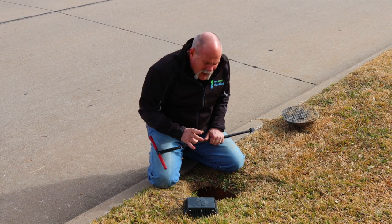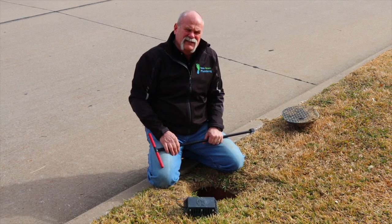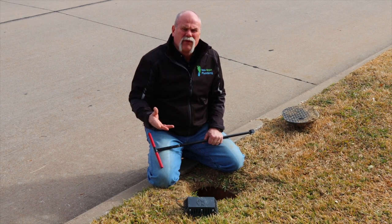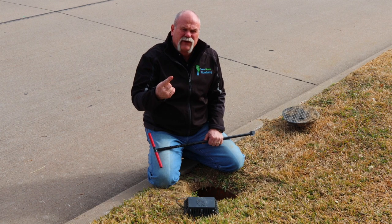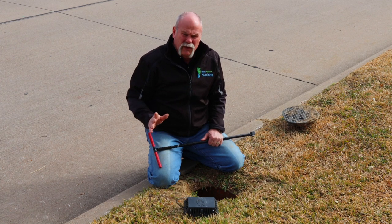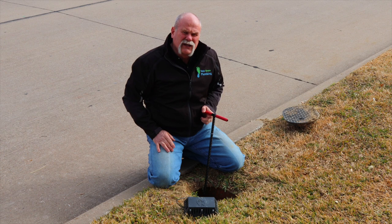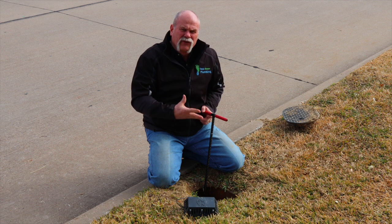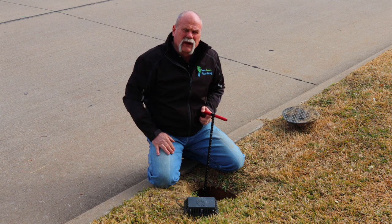I'm in my meter box now. I can see my meter is not spinning, and I also know that because I have the Meter Dog remote leak detection system installed — a great product. Normally when a home inspector comes out or when people think they may have a water leak under their house, the first thing they do is look in their meter to see if the low-flow indicator is turning, or on a digital meter it'll show you how many gallons per minute it's turning. I've got a valve here where I'll turn the water off in a minute, but first I want to put a gauge on at the house so I know what the normal static pressure is when everything is stagnant.